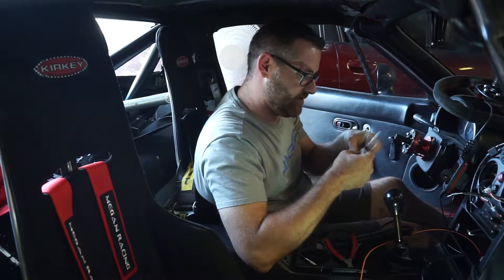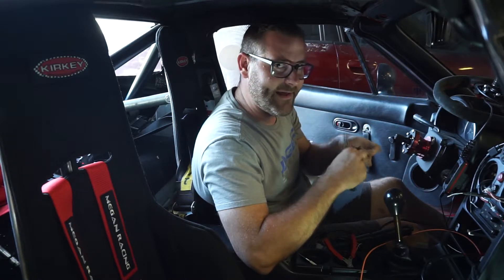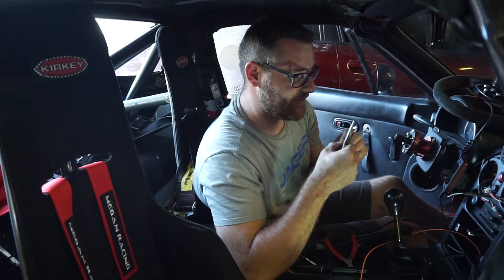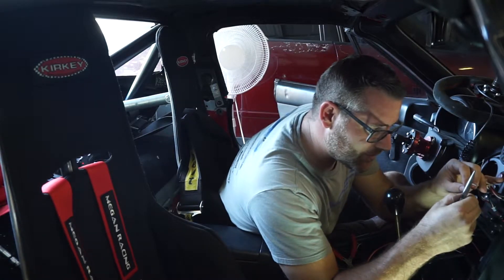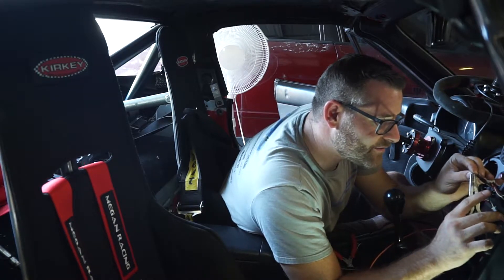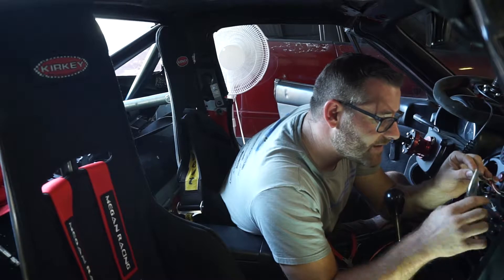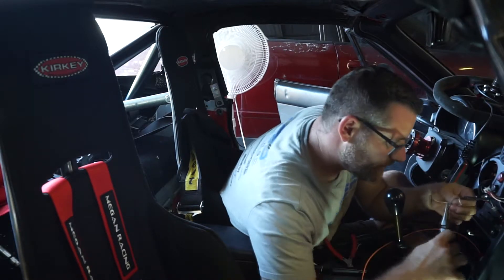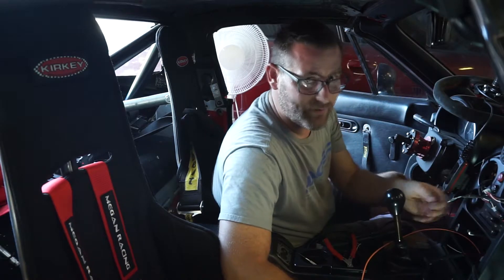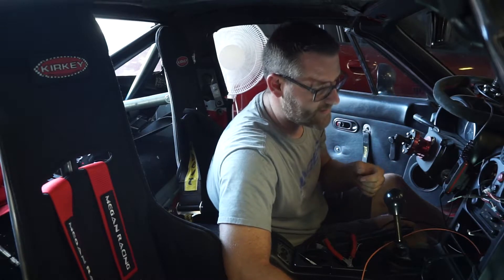You might notice I'm not quite using the correct crimp tool for this — it appears to have gone missing. So I'm kind of doing this the old ghetto blaster way. You have to be very careful — you're trying to crimp one tab on the actual wire itself and the other on the insulation. If you're a professional, you can get this accomplished with some needle-nose pliers. If not, I highly recommend getting the correct crimp tool. One thing to make sure to do: the tug test. If you can pull it off, it's not going to stay. Get it right, make sure you pass the tug test, then you can place it.